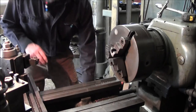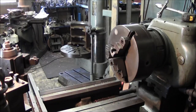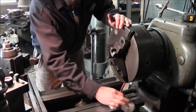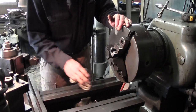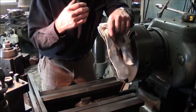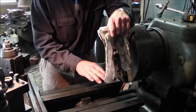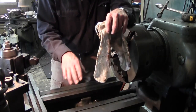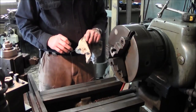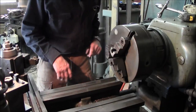All right, let's go ahead and wipe our lathe right here where we put the steady rest down on. We're gonna just wipe a little bit of the debris off of our last cut here. And we always keep our lathes nice and clean. Even though you see me set things on my lathes, I'm the one that puts them there. I set them down gently. I know the importance of them. I don't beat on my lathes, and I don't run anything filthy on my lathes. And I clean my lathes if I happen to do any little bit of grinding or whatever with abrasives. And I cover everything when I turn cast iron. So there's a lot of different things that you want to do to protect your lathes.